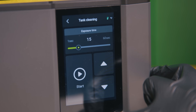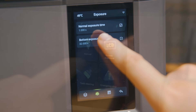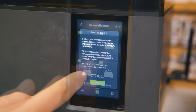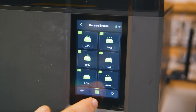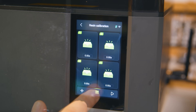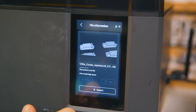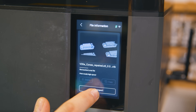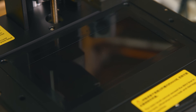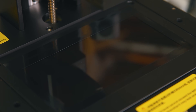But this onboard operating system has some great functions too. You can adjust the printer settings on the machine itself mid-print, and it has the same exposure test feature that the Saturn has. I didn't realise before that you can actually set this to four, six, or eight exposures. All you need to do is create a print file with the same model in quadrants, sextants, or octants, slice it, and import this into the tool on the printer's UI. It's a great feature where the implementation is far better than the explanation Elegoo have given for how it actually works.